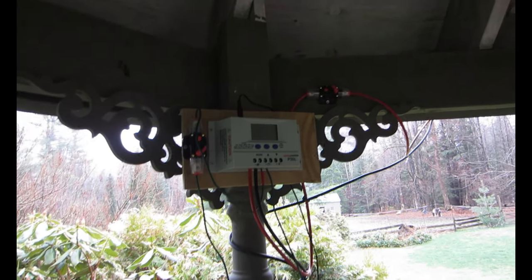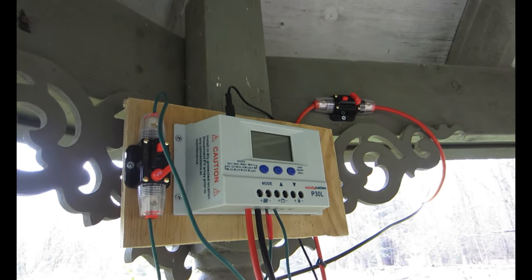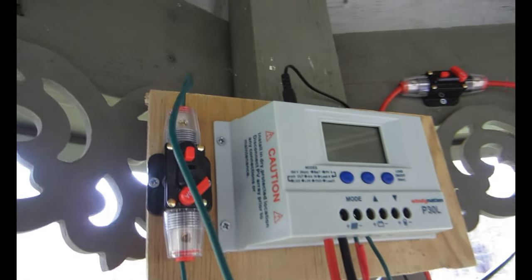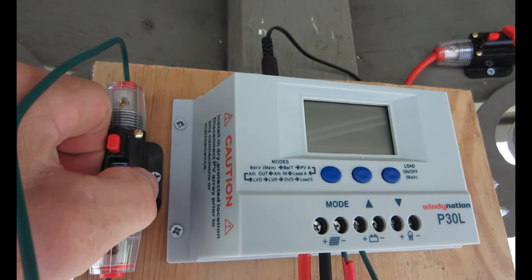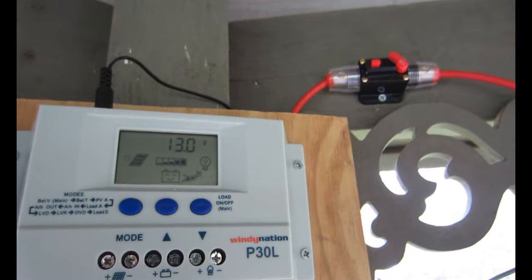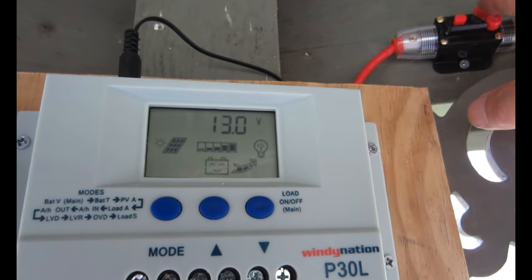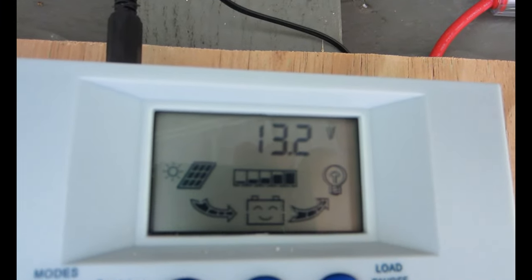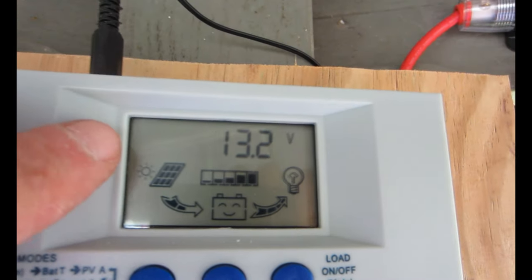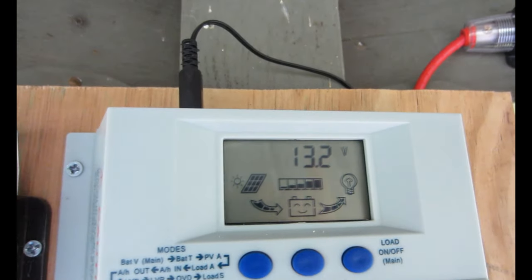I just have to throw the switches for the fuses and circuit breakers for my solar panels and for my charge controller to the battery bank. You want to apply power to the charge controller first on the battery bank, so I'm going to go ahead and throw that fuse — and it should light up — there it goes. It's kind of a cloudy day but we're going to throw the circuit breaker for the solar and you'll be able to see some solar power coming into the charge controller. It takes a few minutes for that to light up — you can see that incoming blinking from the solar panel.